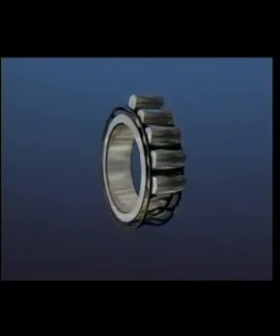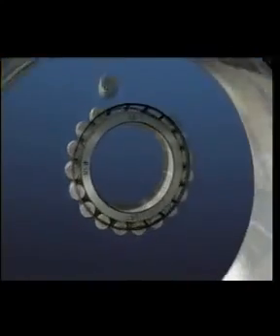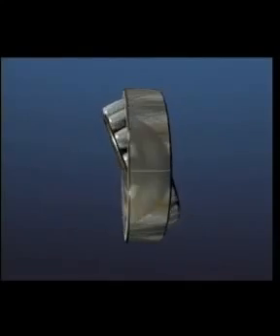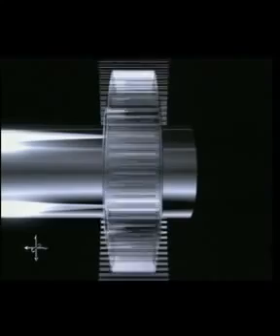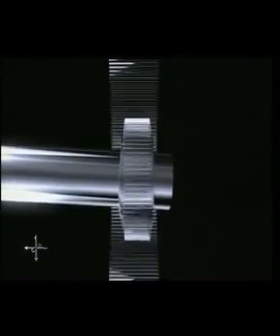The CARB bearing is a unique bearing to SKF and has some remarkable properties. It has a single row sphered raceway and rollers which allows for dynamic misalignment, high radial load capacity, and great freedom for axial movement within the bearing. It is used as the non-locating bearing in arrangements that require large axial thermal movements, in applications such as the drying cylinders on paper machines and support rollers on continuous casting machines.